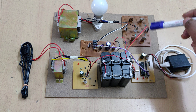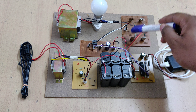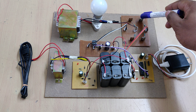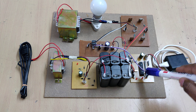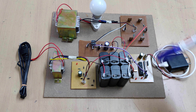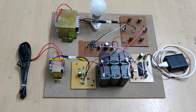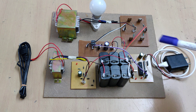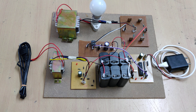With the H-bridge circuit we also get the negative pulses. When two MOSFETs switch on during the positive half-cycle, the other two switch on during the negative half-cycle. The controller continuously keeps switching on and off by providing 50 Hz pulses, since we need 50 Hz frequency at the output to provide 230 volts to the load. We need to switch this H-bridge MOSFET circuit on and off 50 times per second to get the 50 Hz frequency.